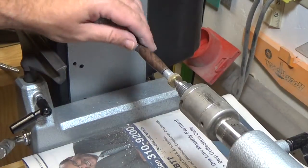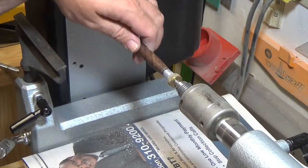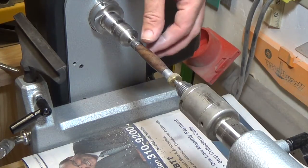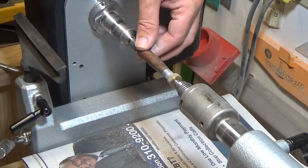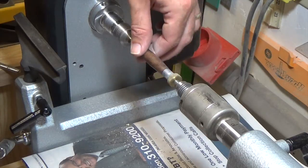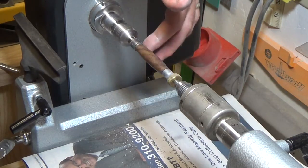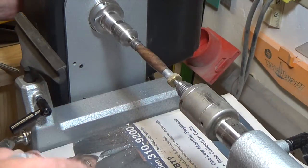So I've sanded out all of the ridges, and truth be told, the ridges were actually a little more than what was tolerable to me. So what I did was take a 400 grit and take it down with the 400, and then I hit it with one more coat of CA to smooth it out, paying more attention to how smooth it got, and then gave it a light sanding with 600, and that brought it back to perfectly smooth with the CA finish still intact.